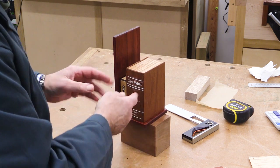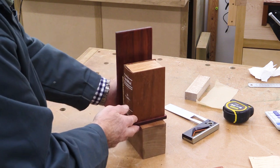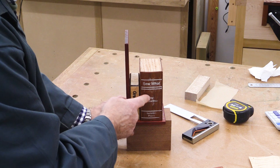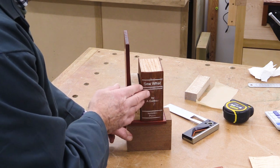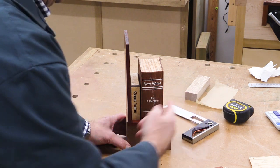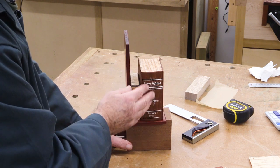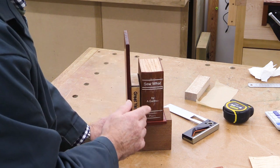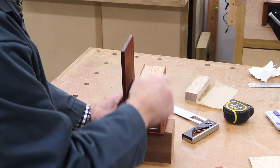The main book itself - I started by making some very thin slices of mahogany. They are at the sides here and at the front. I needed really thin slices for two reasons: first, I wanted to do some engraving here and fill it, as you can see. My CNC is only a 2.5D CNC, so it can't tilt when it does its engraving - it can only work flat. So I engraved that with the wood flat, then bent it to give the appearance of it being part of a book.